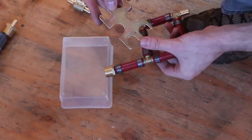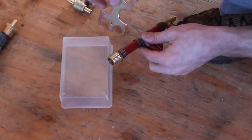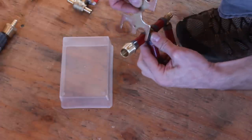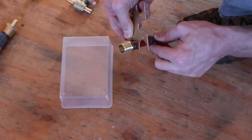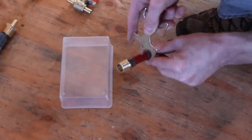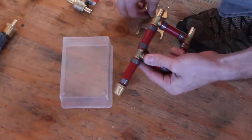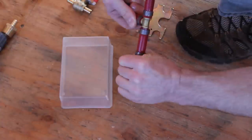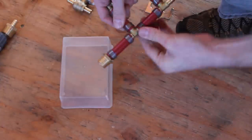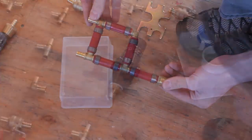It comes with a little gauge that says 'go' and 'no go' on it, and you're supposed to check that the ring once it's crimped will fit in the 'go' and will not fit in the 'no go'. I'm finding that the tool squishes the ring a bit unevenly — it's not a perfect circle — so I can see it won't go on the wide end, but on the narrow end it will slide. Hopefully it's still good. It looks like it's squished the pipe securely and I can't really move any of the fittings, so I think it's gonna be good.